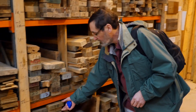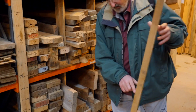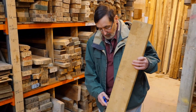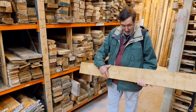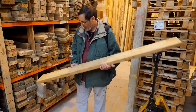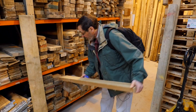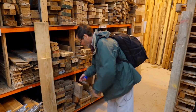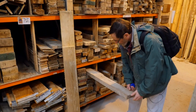My apron material, boy, look at this here. This is perfect. So I can get aprons out of this. Is it long enough? Not quite long enough. Rough sawn again. But what this will do, it'll do my cross rails, 1x6. So I could make them 1x6 or cut down to 1x5. Somewhere around there is plenty wide enough. So that's definitely a cross rail. There's another one. And 2.4, that will give me 2 aprons there, so I could get 2 aprons out of that.